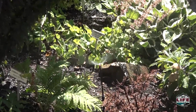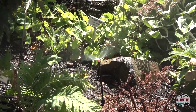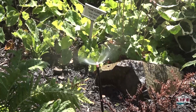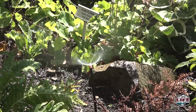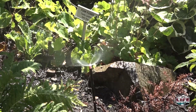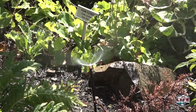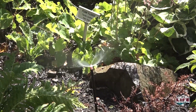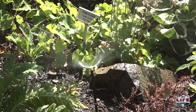So the reason that it doesn't get plugged up is that it has a larger orifice, or because it moves faster because it goes around? It's the larger orifice. It therefore puts out a lot of water, covers a pretty big area, so you need fewer of them, if your area is, that goes about a 15-foot diameter circle. So it's good in that regard.